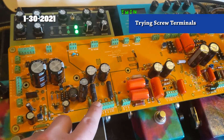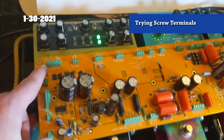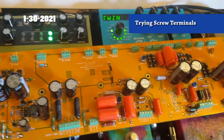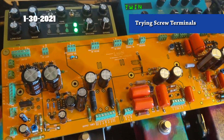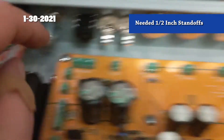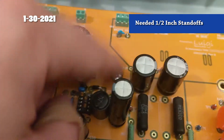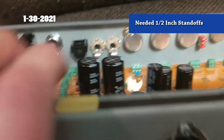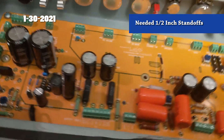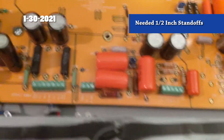The circuit board's done. I went ahead and went with the screw terminals - I may regret it and end up taking them all out and soldering the wires directly, but I really love the idea of being able to pop the board out. I like the idea of a modular build, so we'll see. I started installing the hardware and offboard stuff, but I had to change the standoffs - the ones in the Blues Deluxe were too tall. The filter caps were actually poking out, so that wasn't going to work. If you're doing this with a Blues Deluxe, don't expect the standoffs to match up.